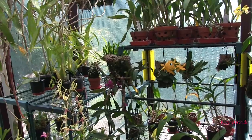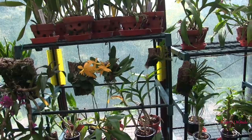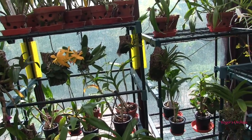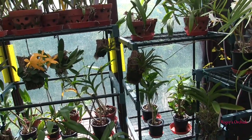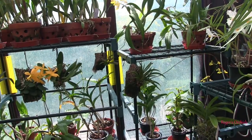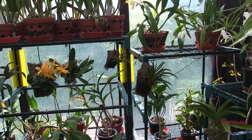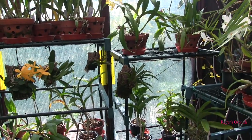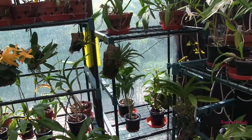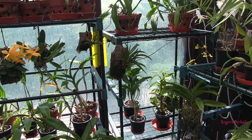So I was bored this afternoon and I've been looking at things like air conditioning units. Bottom line is they're no good in here, because one of their priorities is to dehumidify the air — and that's the last thing I want in here. So an air conditioning unit is a non-starter. Then I had a look at evaporative coolers — swamp coolers as they're called — and these sound great on the surface, until you realize that they only work if the air coming into them is dry.